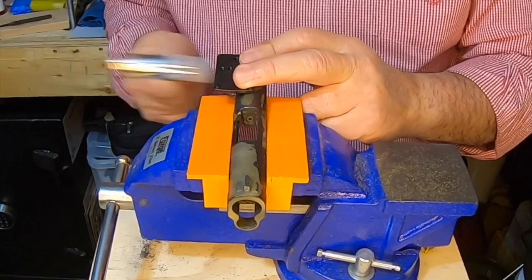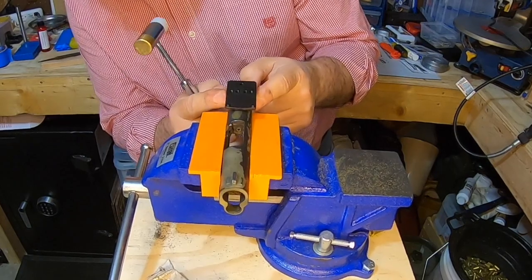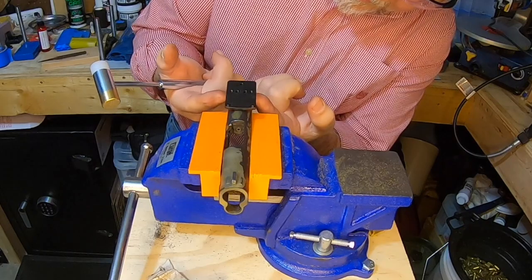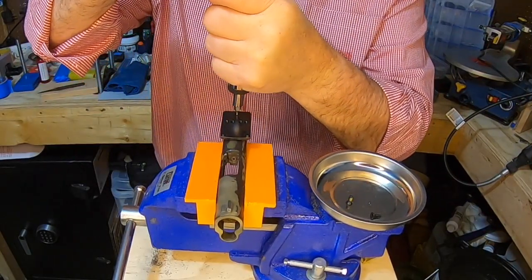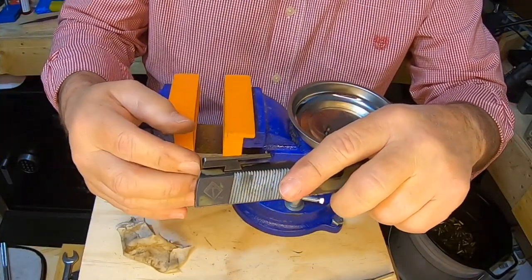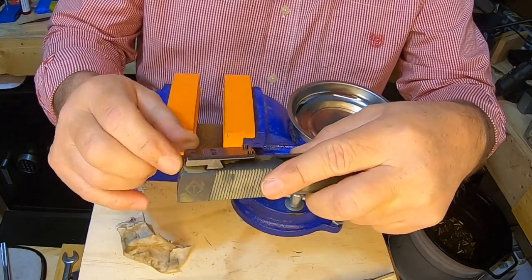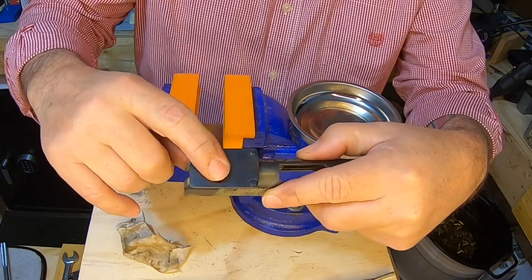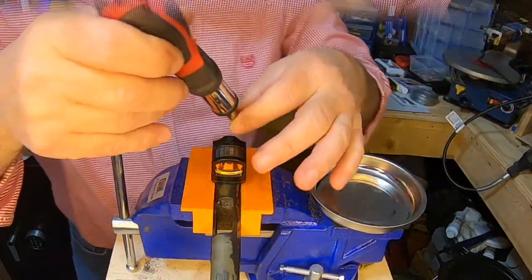Nylon mallet, we just want to tap it into position. So you want to make sure you center it up on here. So we got just a little bit of overhang of the sights here and here on the bottom of the Novak sights. I hit the top of the slide here. What I want to do is just snug it down. See how the plate is sticking up off your slide here? So the rear screw is just keeping a little pressure on it so that you don't get any flex or rock in it. This rear screw back here, we put these two front ones in to hold it down. And now let's get our optic set on here.